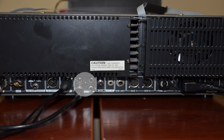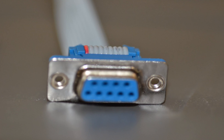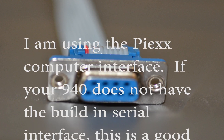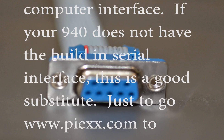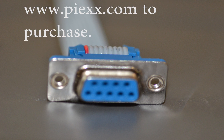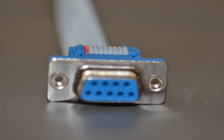Next to it you will see the input from the BNC plug that connects up to the LPPan2. The gray cable coming out of the TS940 is the connection to the computer for computer control of the radio. It is essential that you have that connected in order to run this system. Since this output is actually a serial port, depending on your computer you may have to get an adapter that adapts the serial port to USB.